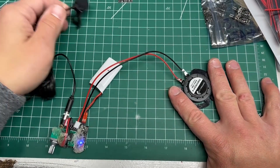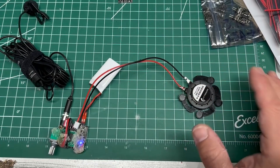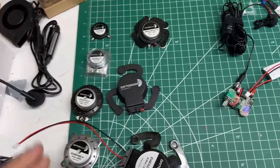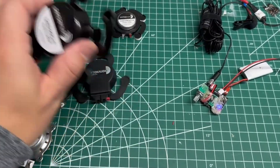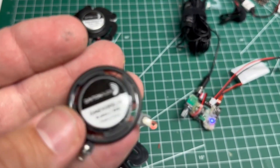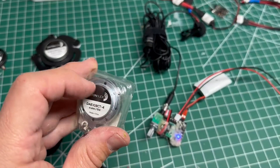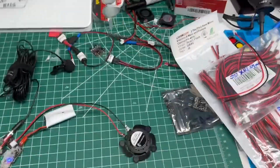Because this isn't directly adhered to the door, it is kind of jumping up and down a bit, so it is rattling a little — but that's only because it's not adhered to the surface. Now just for comparison's sake, you can have all different kinds of speakers. Here are some of the other speakers I've got. That's one of my smaller speakers — this is a coin speaker. These are really only if you need the most compact space possible. You're not going to get a lot of punch out of these, but the vented ones sound better. Vented ones have holes in the back. Larger is always better for output, but not always necessarily feasible.